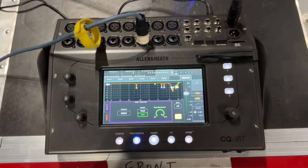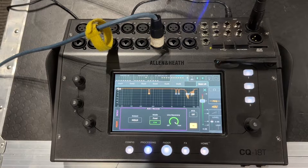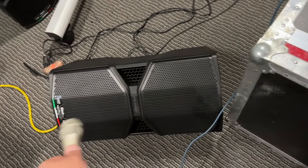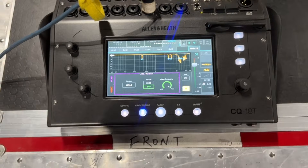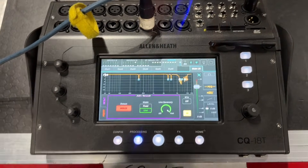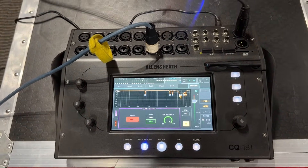A lot of people think that with a feedback assistant you're never going to hear feedback — that is not the case. This doesn't replace the basics as far as mic and speaker placement. It's going to feedback and then the unit's going to catch it and hopefully take it out. And that's definitely louder than I would ever want to do a wedge — that's ripping. This gives you the ability to ring out your monitors or your main PA, and once you have that set you can always hit detect and put the hold back on, which keeps everything frozen in place and it's not going to detect any more stuff. That's how you use the feedback assistant to make sure your monitors are clean and nothing's feeding back in your PA.